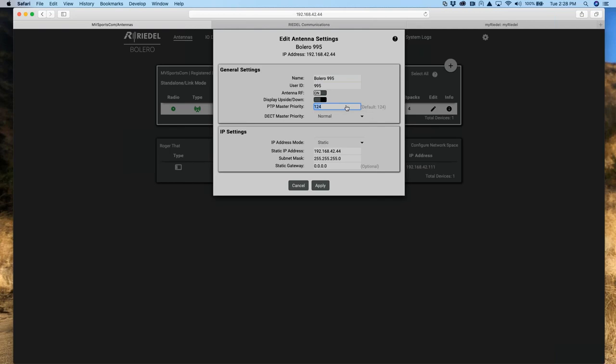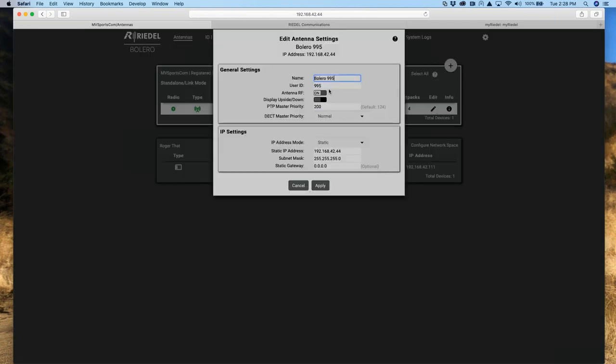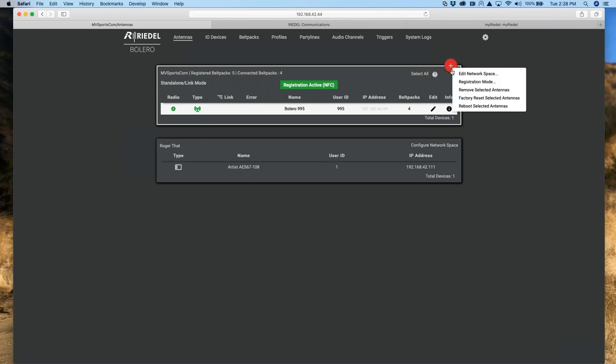And if that's not right, the audio packets are going to fail out and you're going to get frame error rates. So it's caused by a network problem and you have to deal with your network. That's how you fix it. Yeah, it all sources back to the network and the network health and building the network in the right way and recognizing and respecting QoS policies. You're not going to get PTP working if it's not working that way.